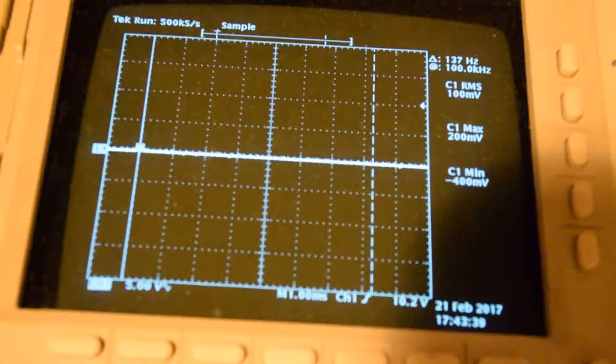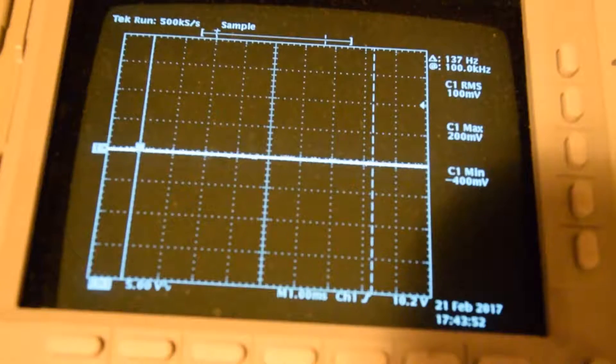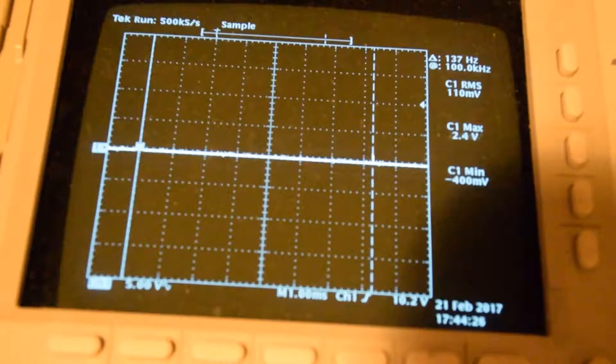I don't know how well it'll work, but I guess we'll see in about a few months from now. This battery right now only holds about two and a half amp hours and it's rated at 40 amp hours. It's charging up to the full voltage, but I can only get about 26 watts out of it before it goes flat. My other three batteries are similar — I can pull anywhere from 200 to 300 watts out of those before they run down, which is about 50 percent of their original capacity, about 15 amp hours for a 40 amp hour battery.